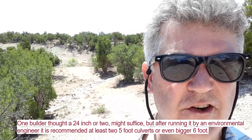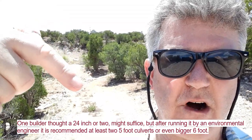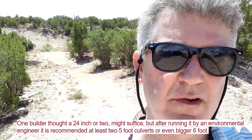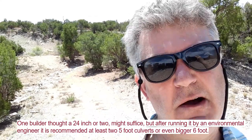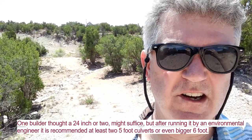This next one's pretty bad too — I'm sure it's going to be a 24-inch culvert that goes across here. You can see the wash through the road behind me going up to the build site. A larger culvert, probably a 20-foot section. It's washed out pretty bad — a lot of soil and rock and compacting needed to really bury and clean that area up to help with future drainage and erosion problems.